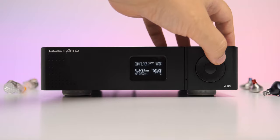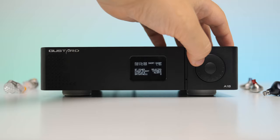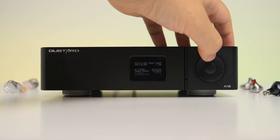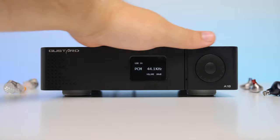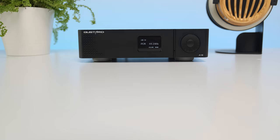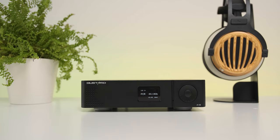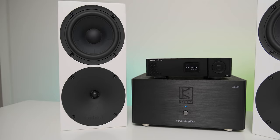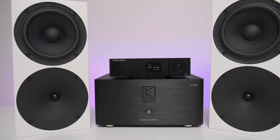As for the tech inside, I was a little shocked by how much technology was moved from the flagship A22 DAC to the A18 while slashing its price in half. Take the DAC chip: it's exactly the same flagship AK4499 from AKM — the only change is that the A18 uses a single one instead of two as on the A22. The most important changes are at the current-to-voltage conversion and low-pass filter. Instead of a very expensive all-discrete circuitry with tens of transistors working in Class A, the A18 uses a dozen LME49860 op-amps. A linear regulated transformer handles power cleaning, and four voltage regulators lower the noise floor even further. Gustard also used the advanced CSR8675 Bluetooth chipset supporting LDAC and aptX HD, plus Bluetooth 5.0 with an antenna for stronger signal coverage.